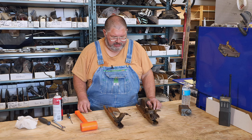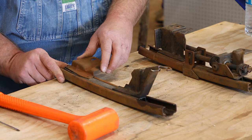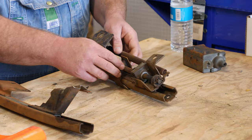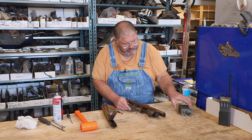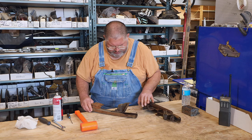What we'll work on today is the seat mechanism for a '59 Eldorado. There are two halves to it — this one side is just a roller for moving fore and aft, and then this one here has the actual screw mechanism that powers the seat fore and aft. A cable is connected here that leads to the motor, which is mounted on the passenger side, with a flexible cable going between the two.